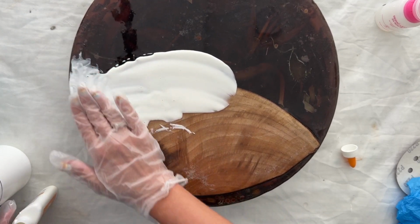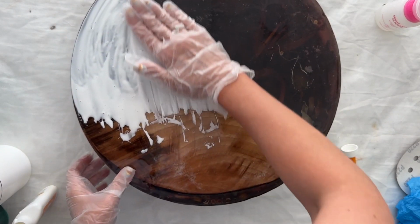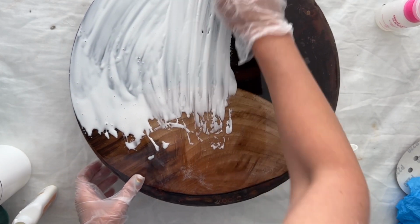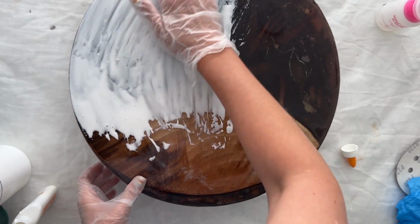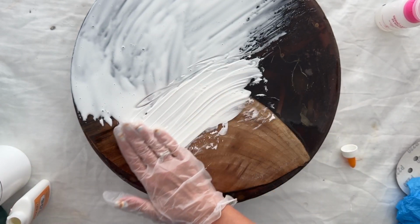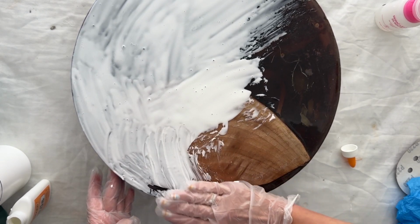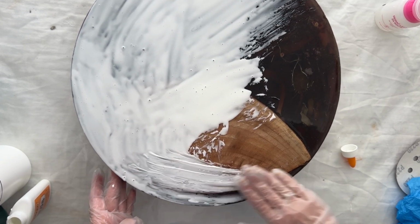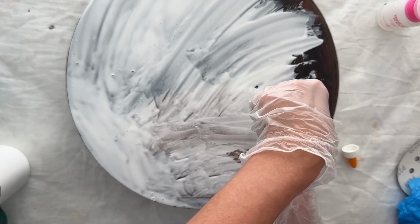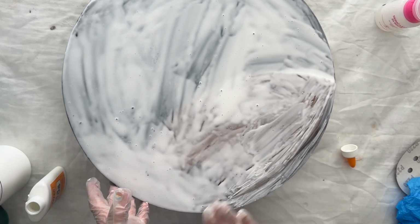Right now, at this stage when I apply the glue, I'm going to stir the resin. You also have a choice. You can make the finish medium thick or in principle as liquid, but liquid is the most brittle. I don't recommend it, and I will make the finish with the same resin, not construction, but for three-dimensional fillings. So I'm going to do the finishing coating with the same resin I used to make this table, but I'll cheat, I'll add a little more hardener, and my resin in 4 to 5 hours will already start to polymerize. Because as we all know, resin for three-dimensional fillings polymerizes longer than artistic resin, and I have to wait. And I'm going to create a caramel edge so you can watch and decide for yourself how you want it.